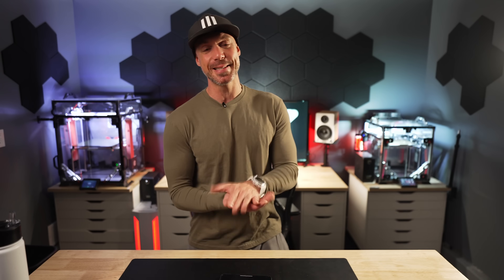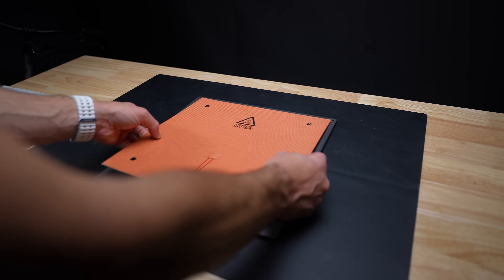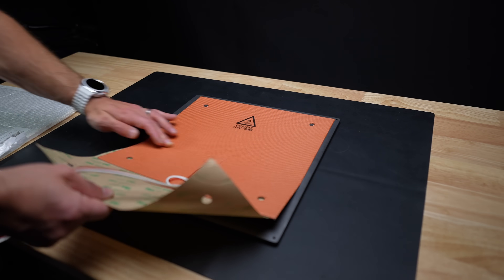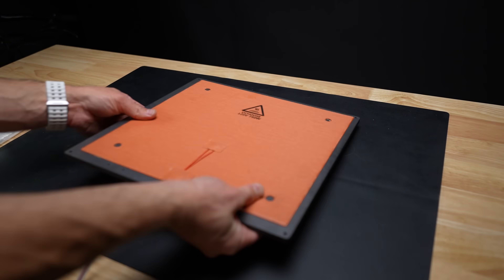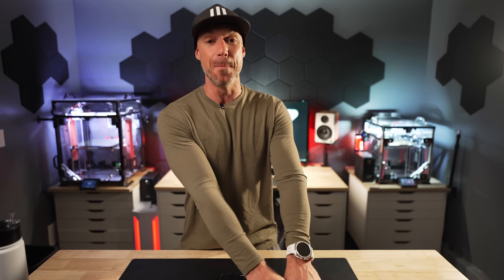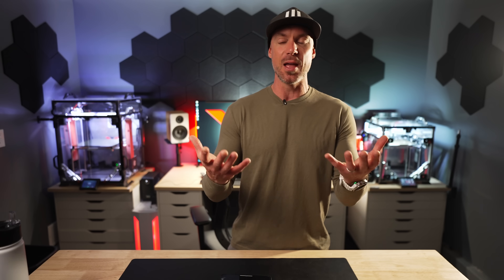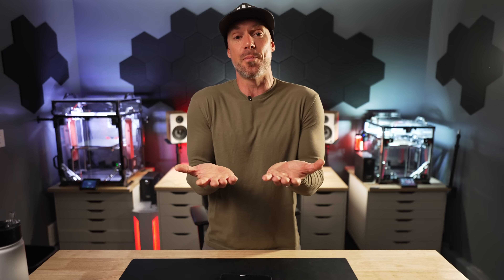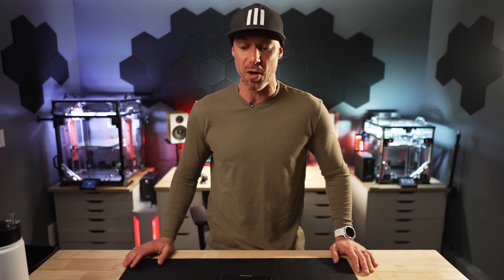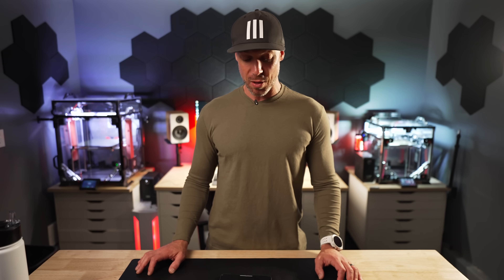Then it was time to install the silicon heater under the graphite bed plate. To my surprise, it sticks very, very well to this surface if you clean it first with isopropyl alcohol to remove any grease and residue. I didn't even bother installing an RTV gasket around the bed plate. I've found it always sticks super good — even if I want to manually peel off the silicon heater, it's a real struggle. I've never had a falling bed in my entire life. Plus on both of my printers there's a frame plus silicon spacers plus other stuff that holds everything against the bed plate so it can't go anywhere. So installing a 100°C thermal fuse and connectors, and it was ready to go.